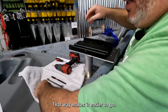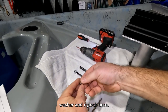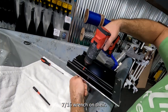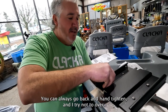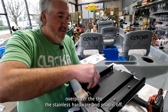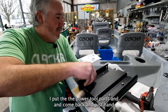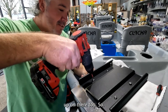Cleaning stuff up keeps my workspace nice and makes it a little easier to go. On the bottom of these guys, I'm just going to use a flat washer and a nylock here. Get them on there — 7/16th wrench on there. Then you can always go back and hand tighten. I try not to over-tighten — some of your drills can really overpower the stainless hardware and snap it off. So I try to just snug everything up with the power tool and come back with a hand screwdriver.